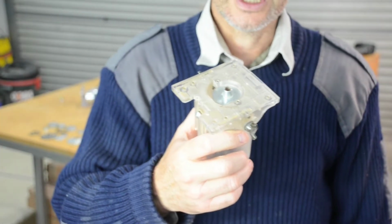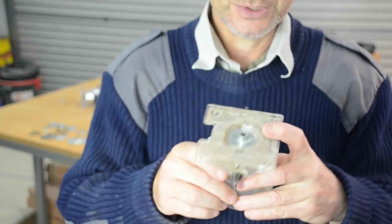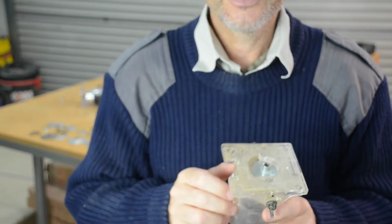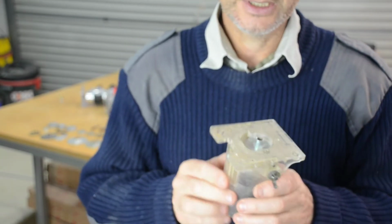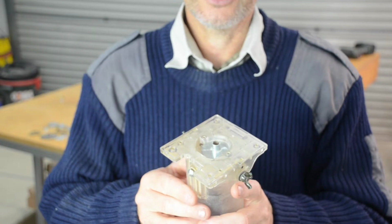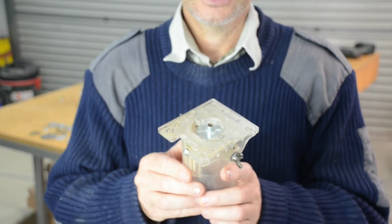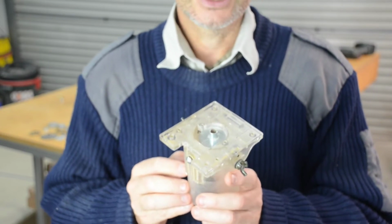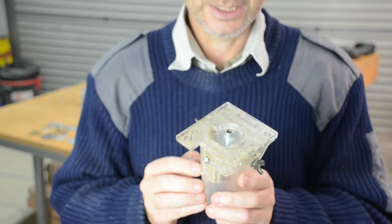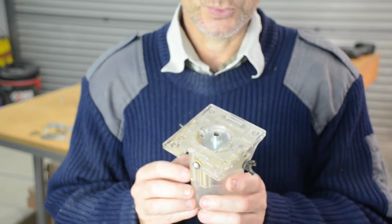Now, the only thing you've really got to worry about is that the difference between the outside diameter of this template guide and the cutter determines that offset. Now, the templates that I've designed are designed for a fairly tolerable range of between 3mm and 1/8 of an inch. Of course, the template guide occurs both sides of the cutter, so really the difference between the cutter and the template guide is anywhere from about 6mm to about 6.5mm, well actually 1/4 inch.